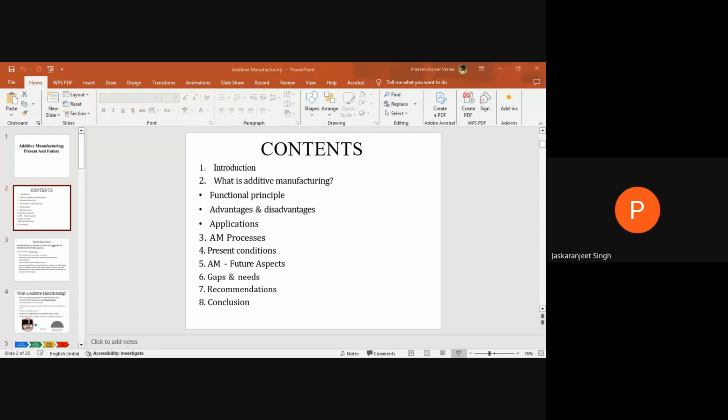Now, if we talk about ceramics, they are applied in electronics and biomedical applications. Ceramics are primarily used for applications requiring high temperature stability, wear resistance, and chemical durability. Alumina and zirconia are widely employed in biomedical implants, for coating purposes, in aerospace components, and in cutting tools due to their exceptional hardness and thermal resistance. There are also silicon carbide and silicon nitride. These are also ceramics and are used in electronics, heat exchangers, and high-performance nozzles because of their superior thermal and electrical properties. Hydroxyapatite is another ceramic powder, which is biocompatible and is especially used in bone implants and dental applications due to its compatibility with human tissues.